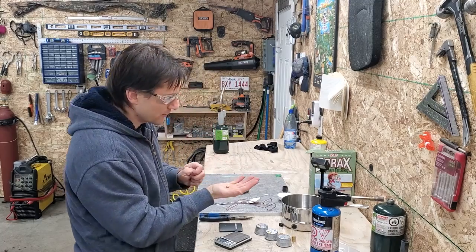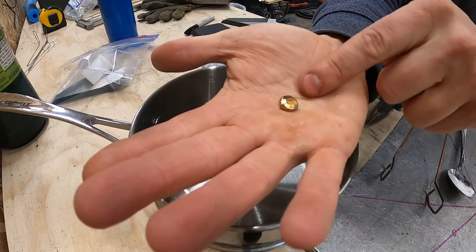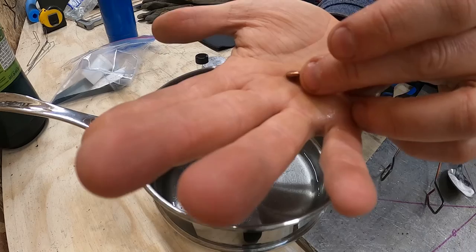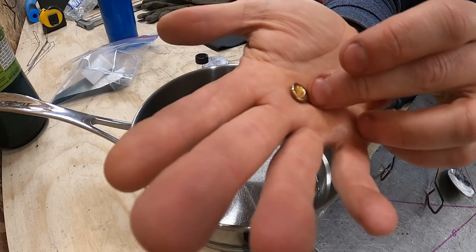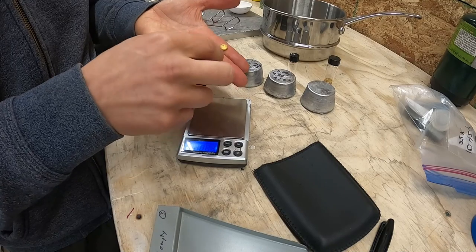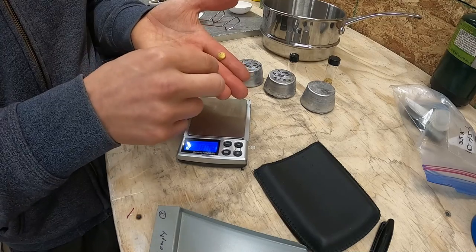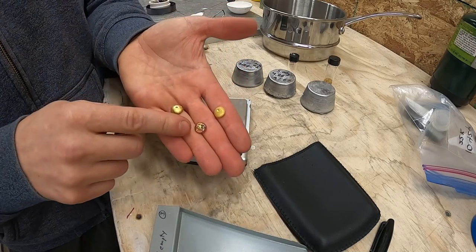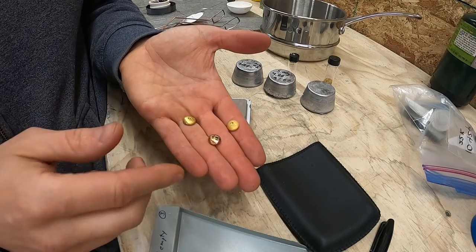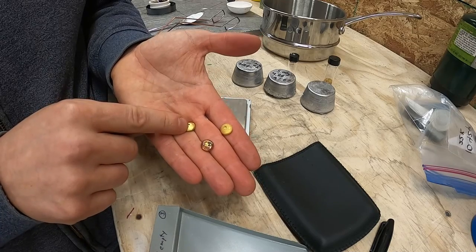Depending on the temperature of that little piece of gold, when you pour it, it'll pour more rounded or more of a splatter shape. Here it's a little bit more, I don't know, it's just chunky. Depending on the temperature when you pour it, you'll see parts look more gold, parts look a little bit colored. That's just a really thin layer of the borax on the surface. And I just took some ultra fine sandpaper to get rid of that. But these worked out to 22 carats.